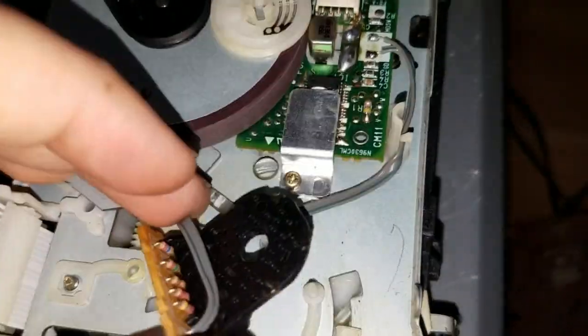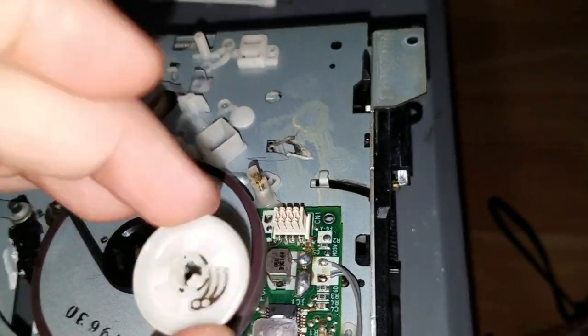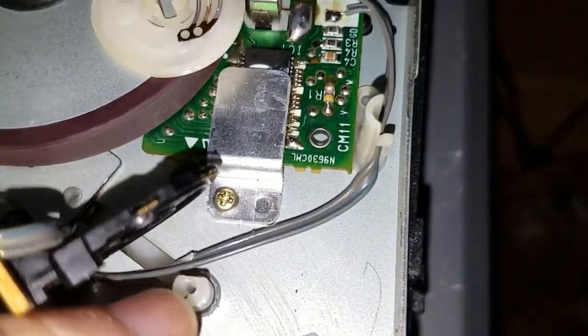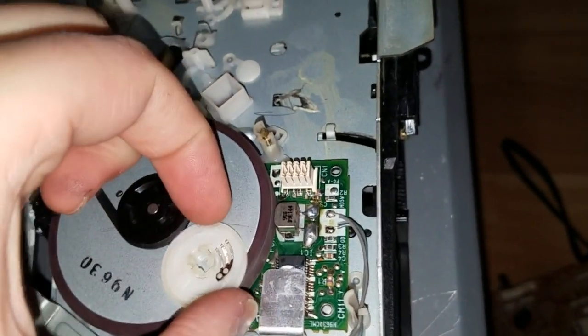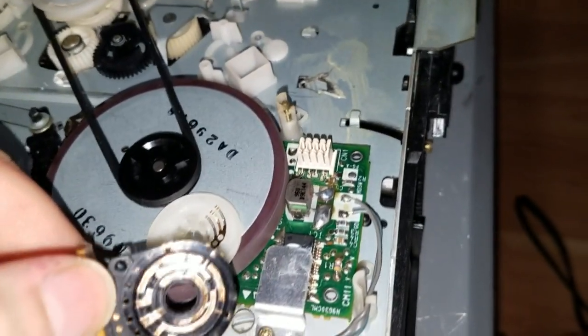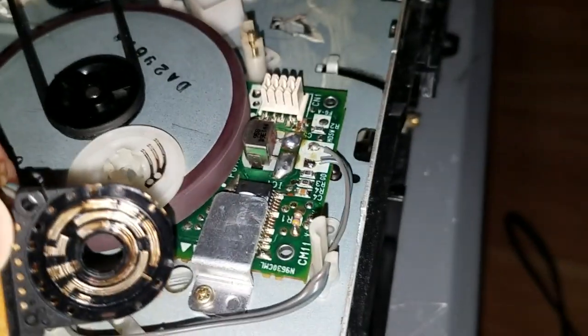There's just a single screw right there to take out. And after that, you just press in on some little plastic clips, and the wheel containing the little fingers comes off. And there's no need to worry about timing because it's a keyed shaft there. It's keyed to the mechanism, so you can't put it out of time by installing the mode switch wrong or something. But if you look in there, the grease is a little dirty.